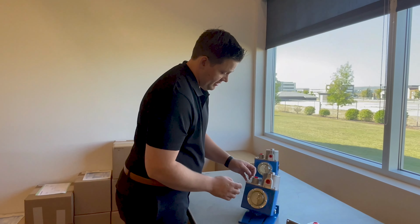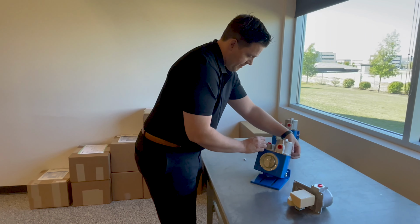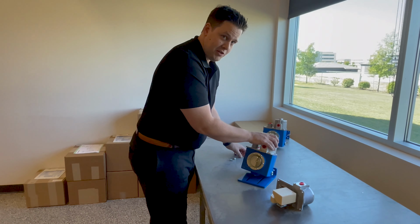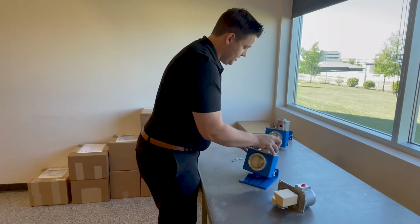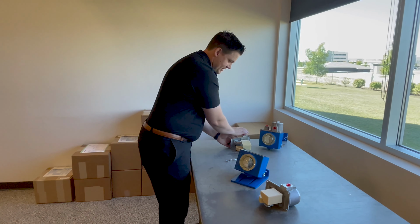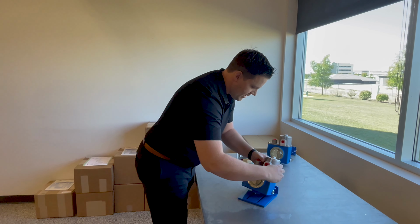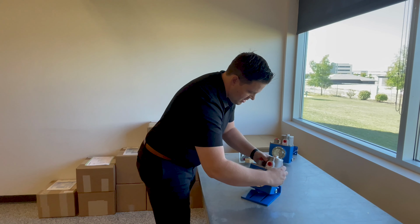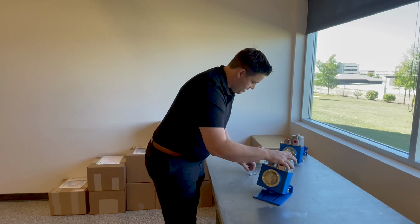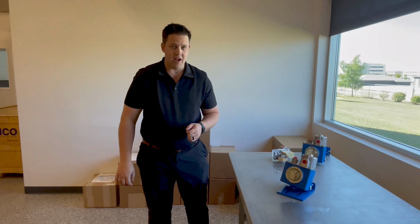It's easy as this. Pop off the 4 bolts on top of the old housing. This is of course after you've disconnected your electrical safety, taken off your inlet and outlet hoses. The entire assembly is just going to come right out. We'll put that to the side, and your new RK-KLCE is just going to slide right in. We're going to button this back up. Once I've gotten my bolts back in place and tightened, put your inlet and outlet hoses back on, safely reconnect your electrical, and this thing's ready to go back online.